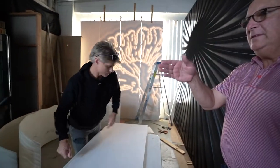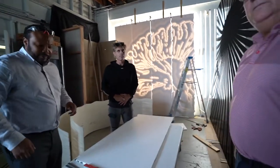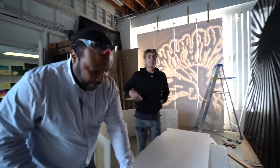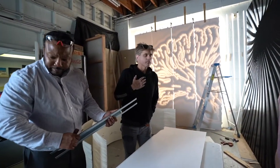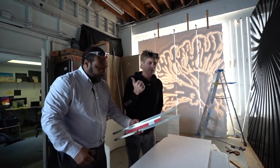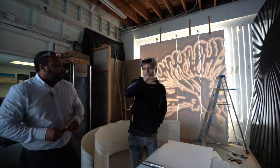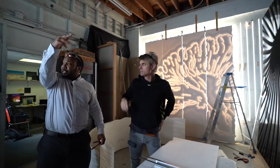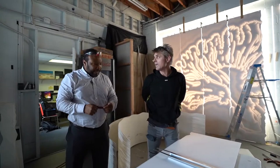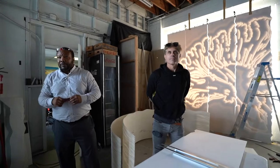So we're going to flip it over. The building downtown LA — the Disney building? Yeah, Disney Hall. They use it; they have it on that building. The exterior? Yes, the panels on the exterior are held with VHB. What's more impressive is that at O'Hare Chicago Airport, there are mirrors — yeah, the United Terminal. All the mirrors in that terminal are bonded with VHB since 1987. So since 1987 — that's 30 years. And it's on the ceiling, with no mechanical connections.